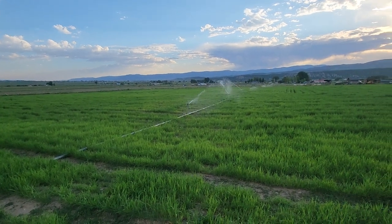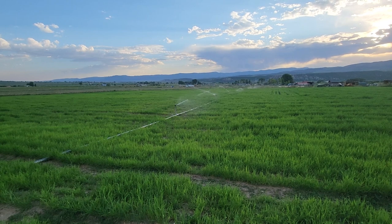There just isn't as much water as there could be, should be, ought to be — never is. It's the joy of a drought. So I might have to rethink this and put a head right over there just to catch the end of the field. But once again, as you can see right there, that head is spinning where the other one was getting stuck. So sometimes you don't have to replace them — you can just adjust them with a calibrated rubber mallet.